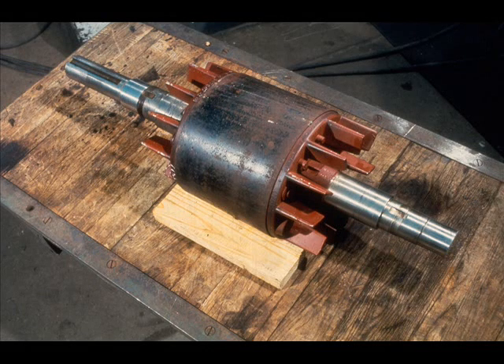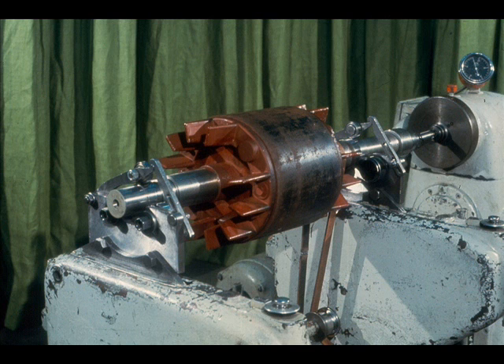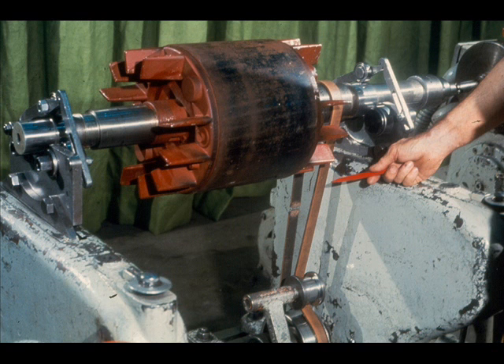This is the piece of equipment we'll be using in this segment to demonstrate the procedures for two-plane balancing. It's a rotor which has been removed from an electric motor. As with our other rotor, we have installed this piece of equipment in a carrier for ease of demonstration. It has already been checked for straight, and the bearing journals have been measured to ensure that they are not out of round. Once it was secured in the carrier bearings, we coupled it to a driver, as shown here. It is now ready for the balancing operation.